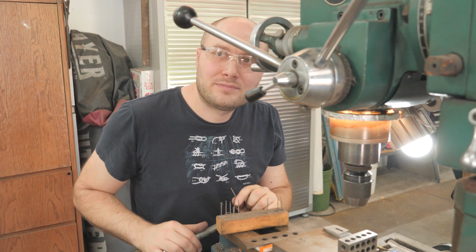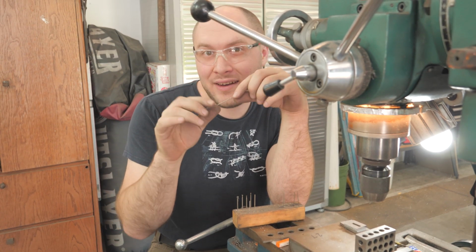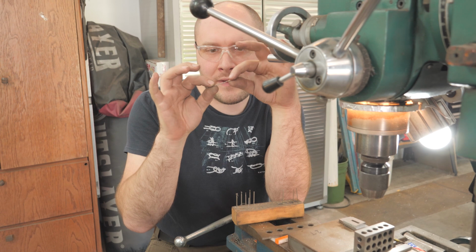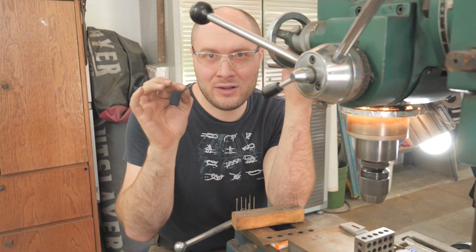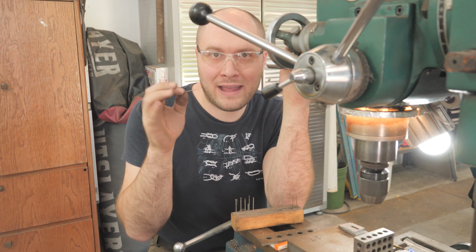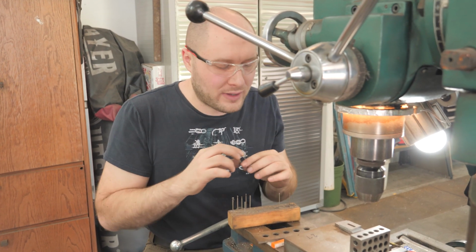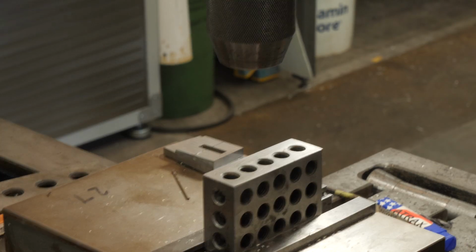Like when you said cobalt, that's the first thing that came in my head. So when I say cobalt, I'm not talking about the brand Cobalt. I'm talking about the coating. They have a cobalt coating on them, and I find those drill bits to be really, really good. The only thing that I've found that works any better is, like I said, solid carbide, if you're just in a really tough pickle and you have to drill something this hard.